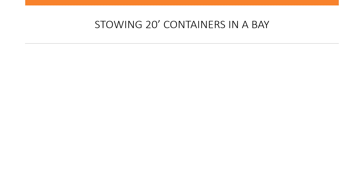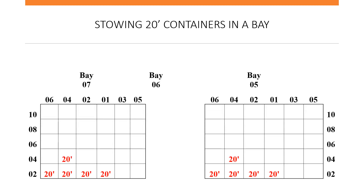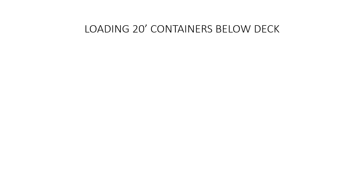Now let us first store the 20-foot containers. Why? 20-foot containers must be stored first once they are on a plan, because they can go on top of each other but they cannot go on top of a 40. So we make every effort to put them on the vessel first. They can be stored in various ways — the key is that they correspond with one another on the forward and after side of the vessel. Just ensure that they correspond.